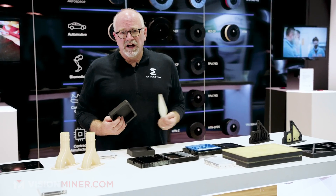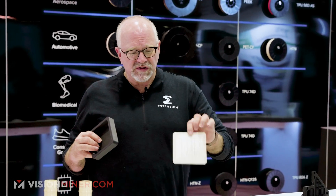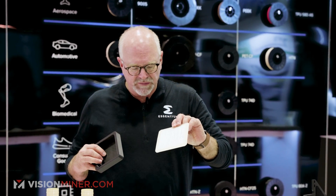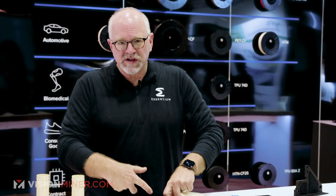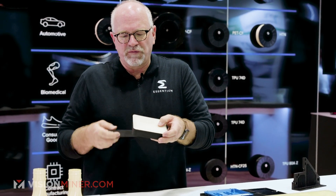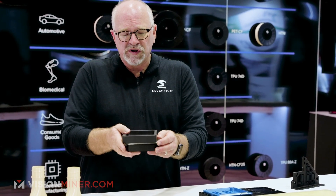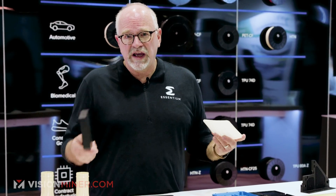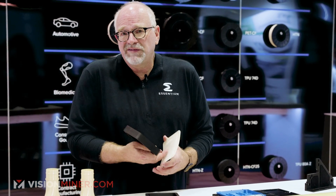What's interesting here is we're stacking these things when we print them. This is actually support material we broke off instead of melting off or washing off — we printed it in air. That's bridging. So instead of filling this whole pocket with support material, we just bridge across, giving you a flat plate with much less material. This is expensive material compared to nylon CTF, so stacking two parts on the same area of the bed lets you increase production and cut down the quantity of relatively expensive support material you're using.